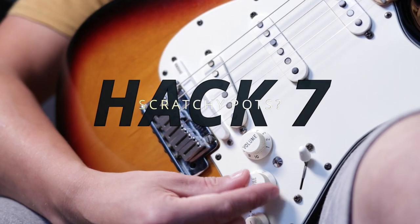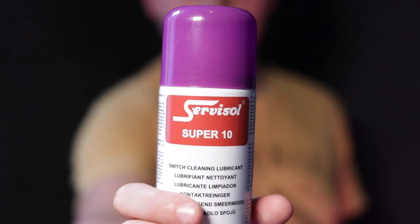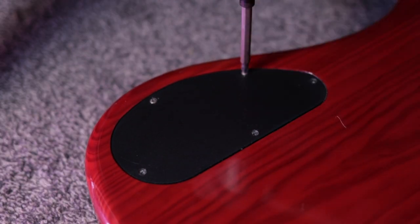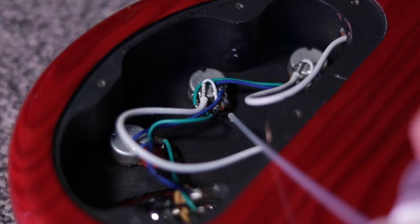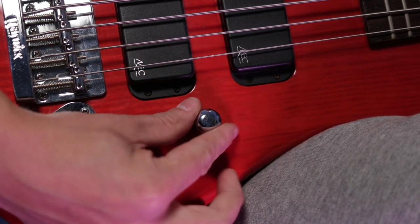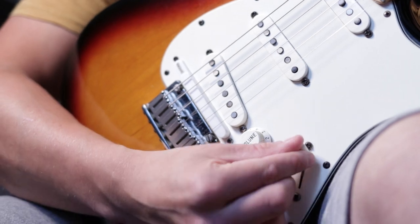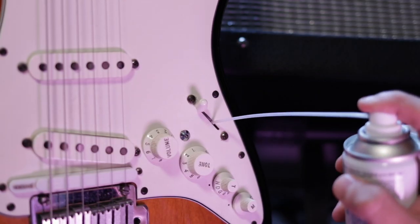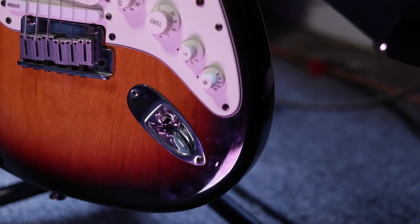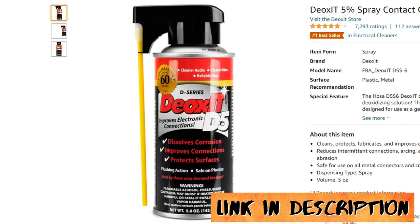If you've experienced scratchy or noisy sounding pots on your electric guitars then there's a simple fix. Grab yourself a can of switch cleaning lubricant, the most popular being Deoxit. Simply open up your guitar to gain access to the pots. You will see a clear opening in which you can place the nozzle. One small spray will do the job and afterwards move the knob back and forth a few times to make sure it gets spread evenly. This also works on noisy pickup selectors — spray it directly into the pickup selector and toggle it back and forth a few times. In fact, go ahead and use this on input jacks, amp knobs and guitar pedals. It's pricey but it will keep your gear well maintained and noise free.